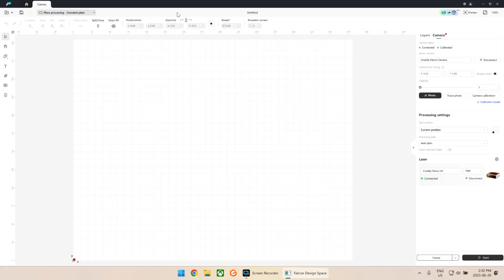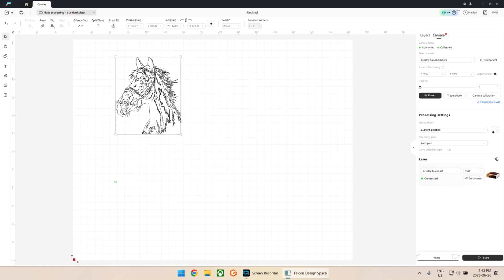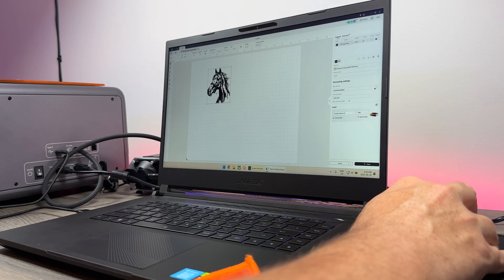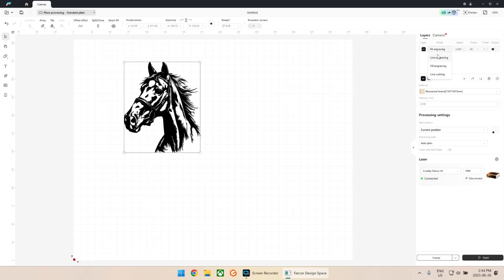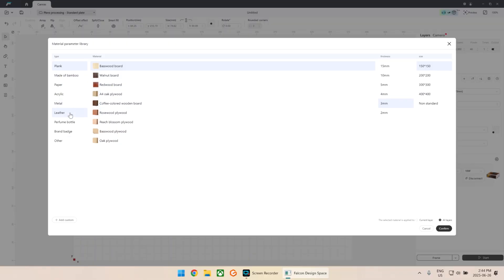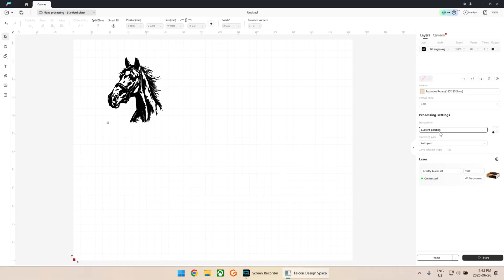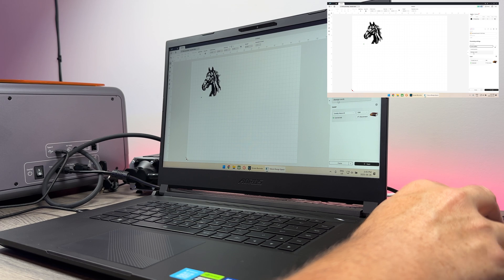So we can go ahead and close that down now. At this point we're ready to start engraving. I'm going to flip that wood over, roughly center it in there. So now we can make a design — they have clip art, all kinds of stuff. We've got a picture of a horse here. Let's make it a little bit smaller. There are different things we can do: fill engraving or line engraving. We're going to do a test fill engraving. And this is where we set the thickness of the wood and the type of material. As you can see, it's a whole list of different materials: wood, bamboo, paper, acrylic, metal, leather, perfume bottle, brand badge. We can set the thickness — right now I'm using three millimeter wood. Over here on the side we can set the positioning, either current position or absolute coordinates — I'll show you the difference in a minute.